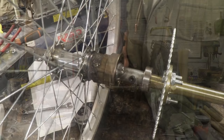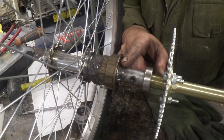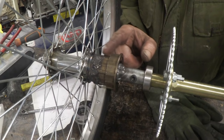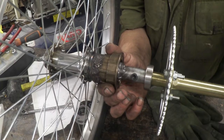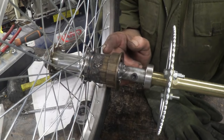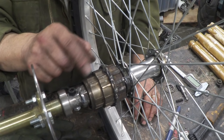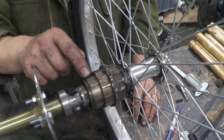Here's a close-up. This is the gear cluster without its gears — the outer sleeve and inner sleeve. The splined drive goes to the inner sleeve. The outer sleeve has been welded to another piece that screws onto the wheel, so the entire outer sleeve contacts the wheel. The inner sleeve contacts only the spline, with a bolt to pull it all together. The outer sleeve is directly connected to the wheel, the inner sleeve directly to the axle. On the other side we used the other half of the freewheel, reversed, and welded the wheel connection to that outer sleeve.